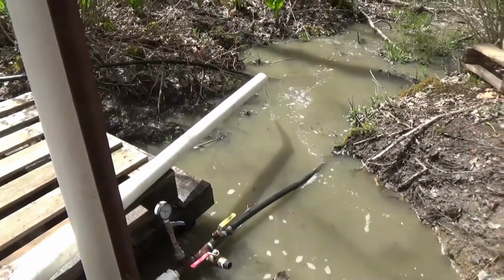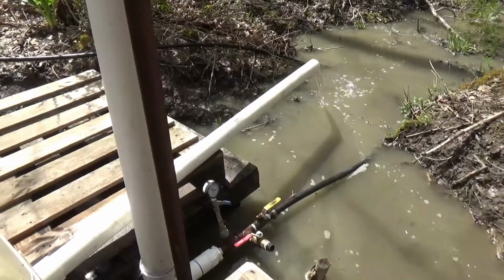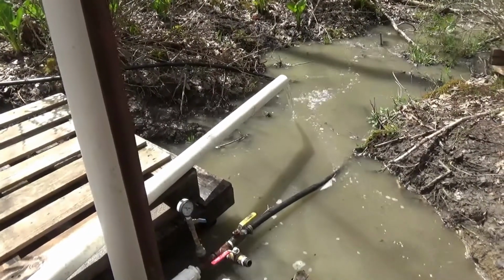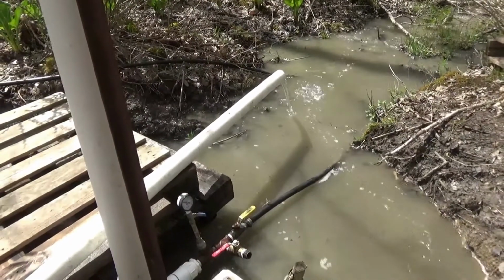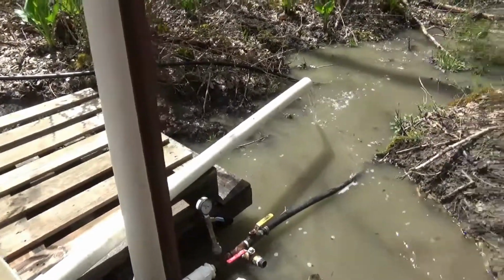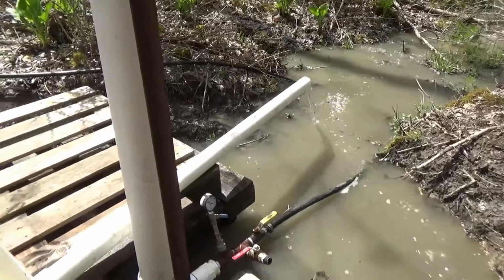We'll be able to take a flow rate of the water coming out of the pump, in other words, total flow through, and also the water delivered up top, and then we can calculate exact efficiency of the pump. So that'll be very useful in diagnostics on future upgrades to determine whether we've increased efficiency or not. Thirdly, this leaves us the option, if we want to put other stuff later downstream, we can pick up the water coming out of the ram pump and run it into some other system. Could even run into another ram pump further downstream if we chose to do that.